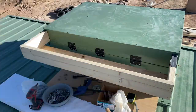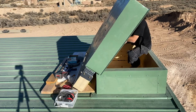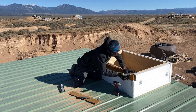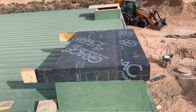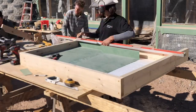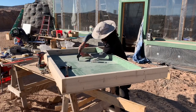In the meantime, I worked on building and installing the operable vent box lids — I could make a whole video just about that, but here's the short version. We cut the foam and added a 2x4 where the hinges will connect to the bases, then wrapped the bases in sheet metal and began fabricating the lids. The lids are framed and insulated with a layer of metal flashing on the underside, which helps shed moisture that builds up on the inside of the lid from the humidity in the greenhouse as hot air rises.